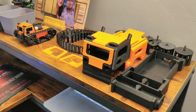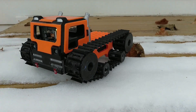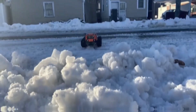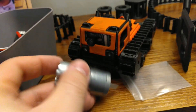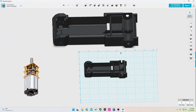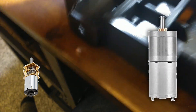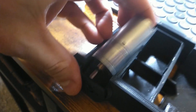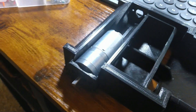How did I do this? I basically just scaled the entire thing up by exactly two. The only thing I really needed to rework was the motor mounts. I have a version of the Scout designed to use N20 gear motors, and as luck would have it, these 370-sized gear motors are almost exactly twice the dimensions — just a bit more round. I was able to tweak some dimensions around, and the large motors fit perfectly.